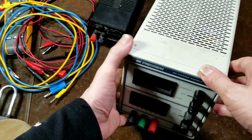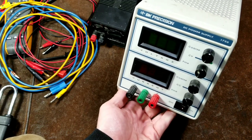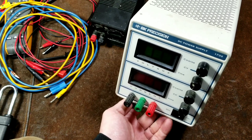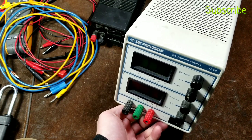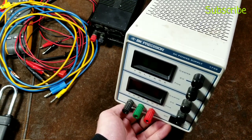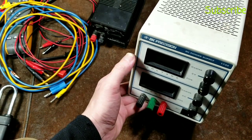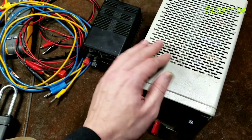This would be just a step down from what would be considered a more serious regulated DC power supply. This is a BK Precision — what is known as an electronic test power supply. The standard on these is up to three amps, variable from zero to 30 volts. These are more substantial: they're either fan cooled or they have giant heat sinks on them. They're a more serious unit. You can manually adjust it to any voltage, but this little guy makes it convenient — you can just click in and it's a lot cheaper than getting one of these.